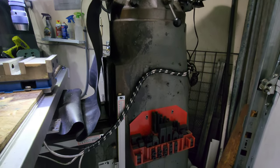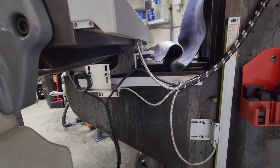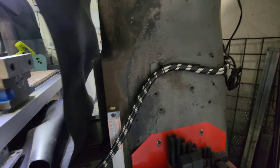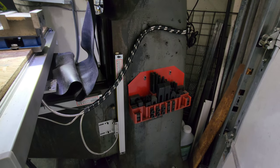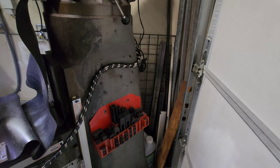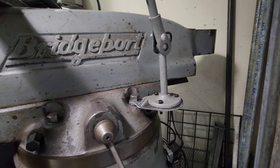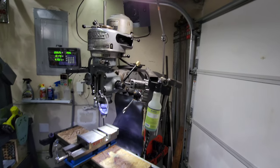So now we're going to take a look at the back side of this machine and how I've set up the wiring. For cable management, I have four wires that come down — three of them go to my linear scales and the other one is a power cable that runs to my power feed. I just have them wrapped up and they walk around the back of the machine. Back here I have a little power box that runs powered from my DRO, lights, and power feed. I also keep my hold-down clamps here on the side, and in the very back I've used it kind of as storage. Coming up to the top, I have a little bracket that holds my light.